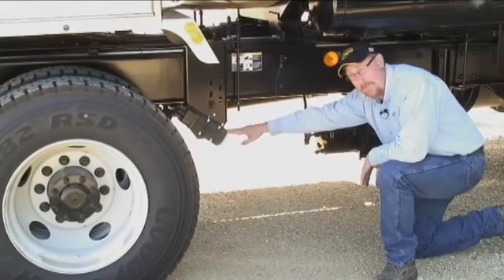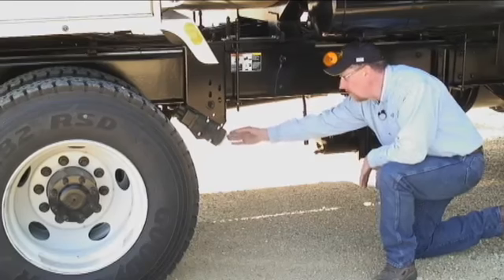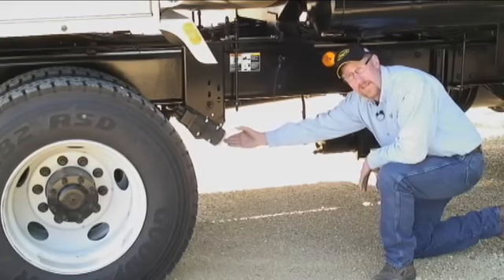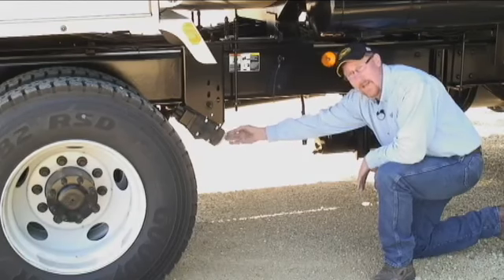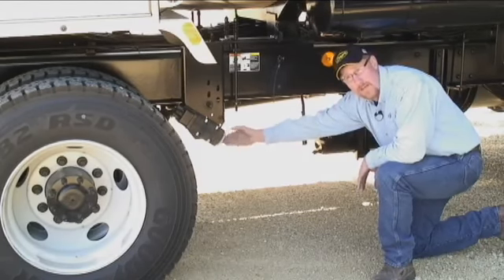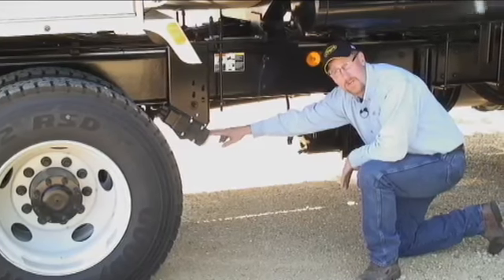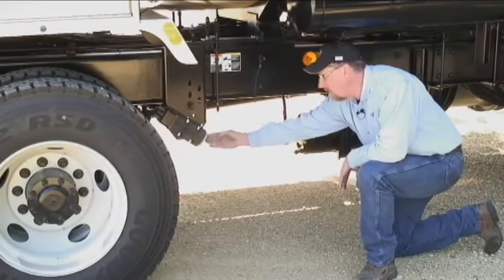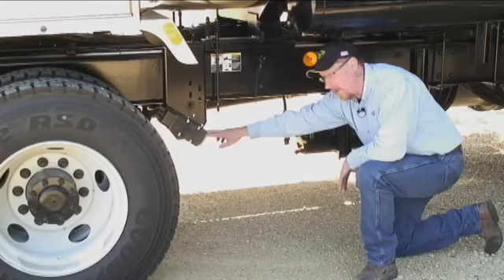The radar has a white lens on it, which may in time get some asphalt overspray on it, so you need to make sure it stays fairly clean. A little bit of overspray won't hurt anything. It is plastic, so using some diesel fuel to clean it is fine. Please try to stay away from citrus orange cleaners, as they tend to bubble the lens, melt the plastic, and cause false readings.